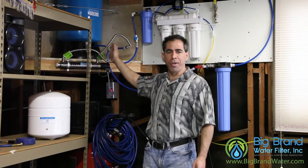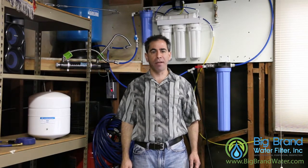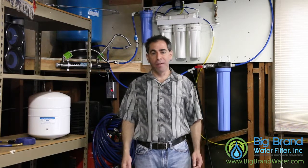Height is a big issue when it comes to reverse osmosis delivery pressure. A lot of people are putting their systems in a basement and then trying to deliver water to the first or second floor. The rule of thumb is that 2.31 feet equals 1 PSI. So if you go uphill 23 feet, that's 10 PSI lost. Going back to the example where you had city water at 50 PSI — you're only getting 60% in the tank, so you start with 30 PSI. Then you've gone up 23 feet, now you're down to 20 PSI. And if that tank is only halfway full and you have 15 PSI in it, losing that 10 PSI going from the basement to the first or second floor, now you're only at 5 PSI.